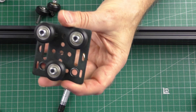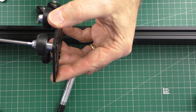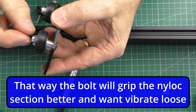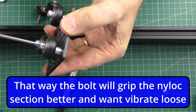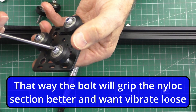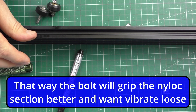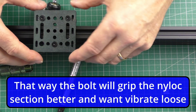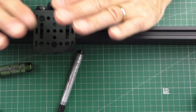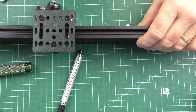Because this is such poor detail — if you turn it this way, you can see the bolt that comes through here doesn't protrude past the nylock. Because these are hard to see when they're on your printer, I'm going to get some new 5mm bolts and make sure the bolts come through. That's a point to note — I don't want that coming loose. Now I can't rock it this way — it's firm — but I can still push it along the track.